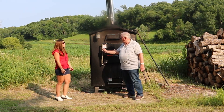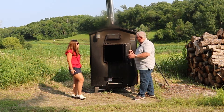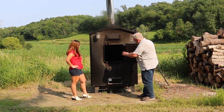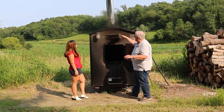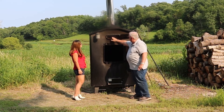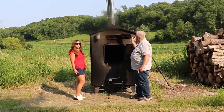This is a C250 model. It's got a 20 by 20 door with ball bearings on it for the latch, so it's a solid latch. Inside the stove there are shaker grates. The smoke actually goes through a three-pass bypass system to get out — it comes to the front of the stove, goes out the back, comes underneath this plate here, and then goes out to the top of the plate and goes to the chimney.